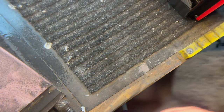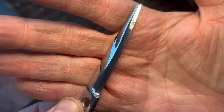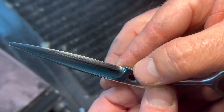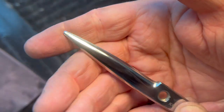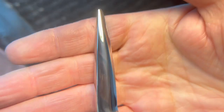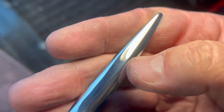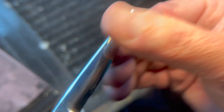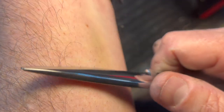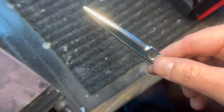Here is the end result — the shear has been polished and reconvexed. You can see a fully reconvexed shear all the way down to the edge. A little bit off in the throat, but this was done with hook and loop, and if you're ever told you can't do something with hook and loop, that's not necessarily true — it's just knowing how to do it to avoid that swoopy cut into the throat. There's probably still a little scratch in this area, but that's acceptable given the level of work required. All in all, this shear is definitely ready to go back to the customer.